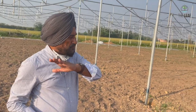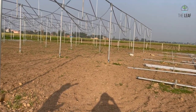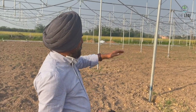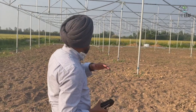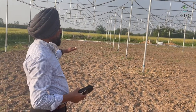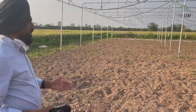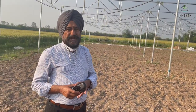The boundary pillars or boundary columns are at a distance of four meters to provide additional support, and the rest of the structure is at eight meters. The north-south columns are again at a distance of four meters. So you will have domes which are eight meters wide and 40 meters long.